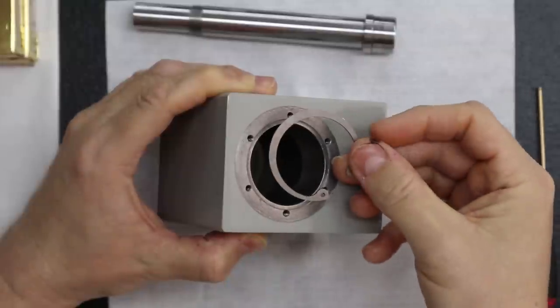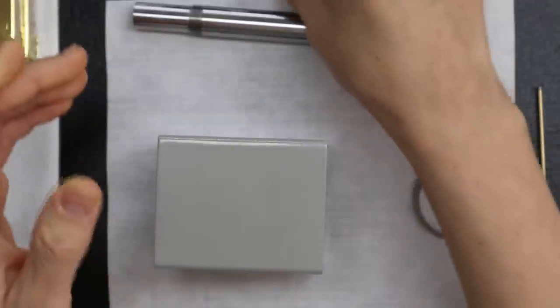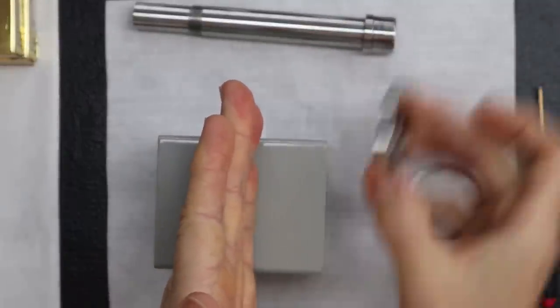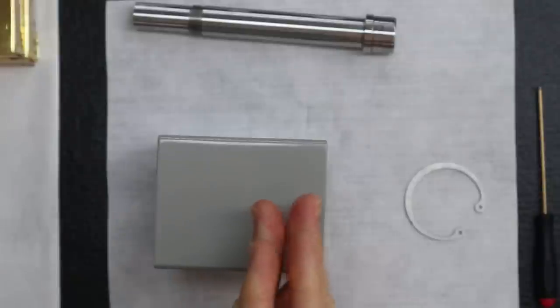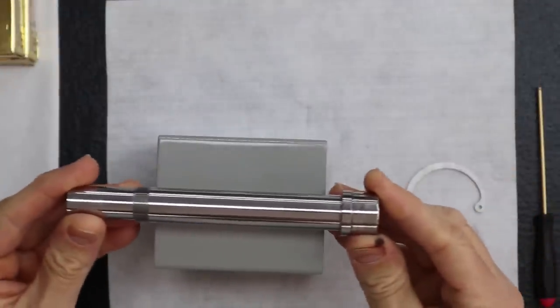Replicating that open style headstock design. Precisely. That way, you'd have the retainer ring on this side, the bearing cap on that side, and that would lock in the pair of angular contact bearings. And it would be quite nice. Yeah, so again, this would be very secure.